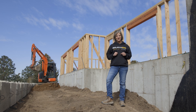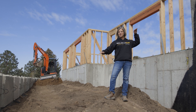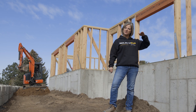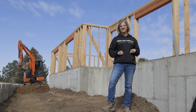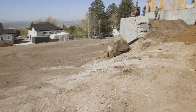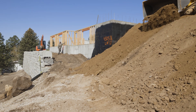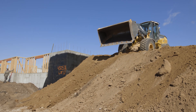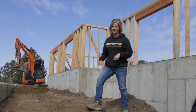We're here in Pleasant View, Utah, where we used helical piles on a slope. The initial land had a large slope on it where we were on native soil on one side, but about 35 feet deep on the other side. Using helical piles throughout the foundation and footings, we were able to drill down to native soil and backfill everything around it without spending extensive time doing that and multiple compaction tests. Let's check out the lot.